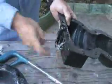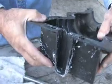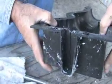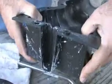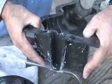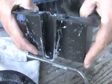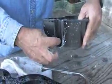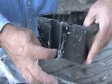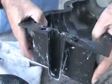Now, this is enough. No concrete's gonna be coming through here, a little bit of water, but it's enough to give you this little bit of flex to unmold it. And you know, it's not gonna crack. You know, you have to give you this much flex. That's all what you need. And if you're afraid it will keep going, you could take the drill bit and drill it here. This way, your saw cut will not continue expanding on you. But that's all what you need, this little bit of flex.